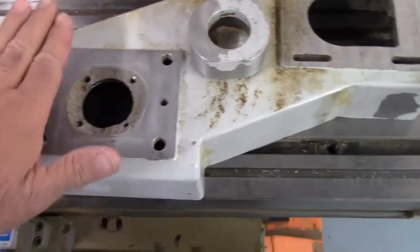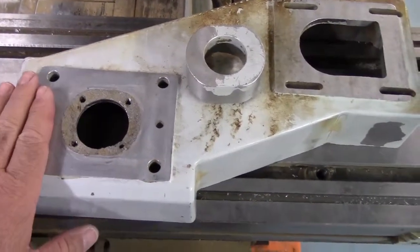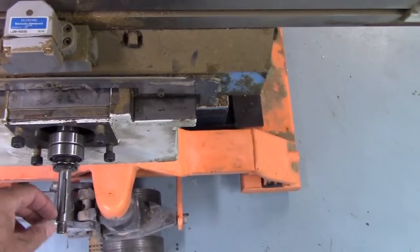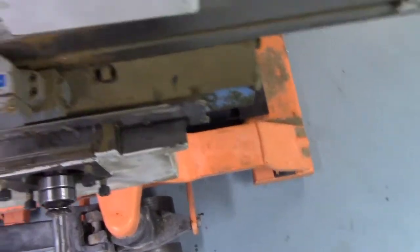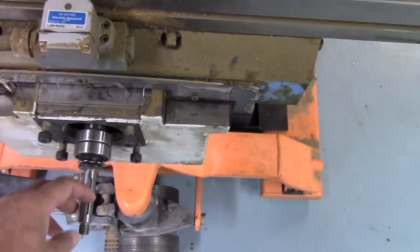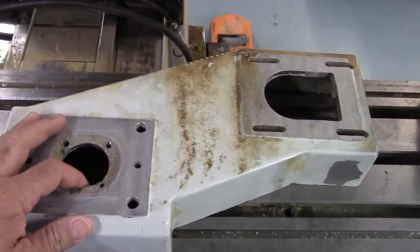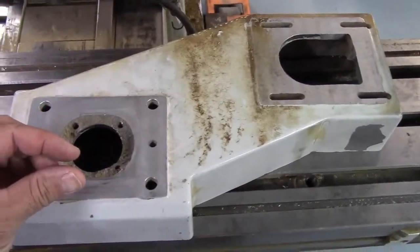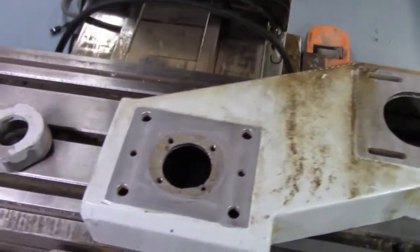The idea is to mill a pocket here for the new steel thrust bearing flange so that we maintain the same depth and don't change the geometry. I think there's enough ball screw sticking out that we could sandwich a plate here. We're going to machine half of this material out - it was about 380 thousandths - so a 190 thousandth pocket here and a 190 thousandth flange for the bearing pocket. That was Brian's suggestion and I agree with it.